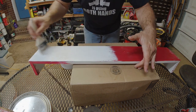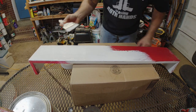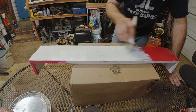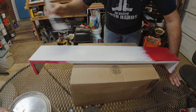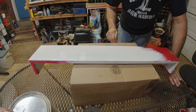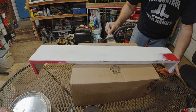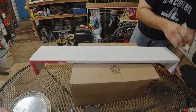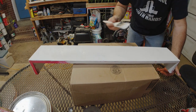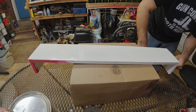I definitely don't recommend getting the paint right out of the can because right now the glue is probably mixing with the paint since it's not a hundred percent cured, and I don't want to mess up an entire gallon of paint for this little project. Put it in a separate container, and when I'm done I'll just throw whatever's left out. I don't want this glue contamination to end up on a wall or trim I'm painting later.